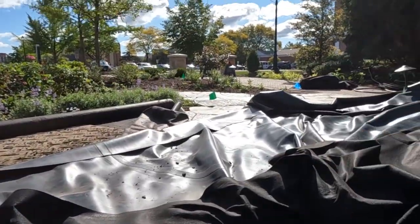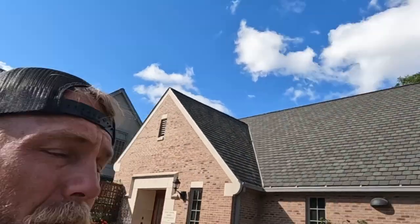So we're gonna go ahead and drop in one of our main stones. It's a larger stone. It's probably the biggest stone on the project. That's going to be a frame rock, but it's also going to set the elevation for everything back over here as well. So I'll show you once we get the stone in and how close that is to top of patio and why I set it that way.